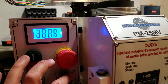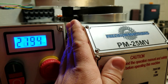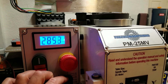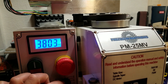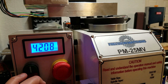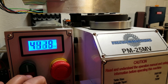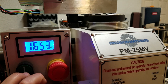These machines were never originally designed to go much more than that — 2200 RPM was the original maximum, and there really isn't any vibration at all at that speed. But now with the upgrade I can crank it up to 3000. I can actually get this thing up close to four, even close to five thousand RPM. But it's not happy up there — it's not real happy running at 5000 RPM, that's for sure. But it will do it.